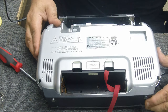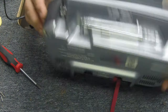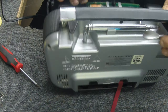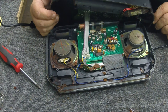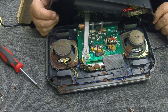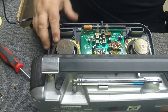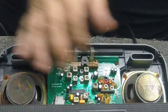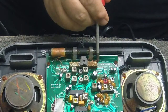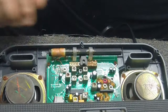Let's get her opened up and see what we got. It has six screws — one in the middle, two on each side, one in the battery compartment. It comes apart now. Oh, look at all that rust. I don't know if that's battery corrosion or rust, but wow — that's not a good sign. No wonder the side switch was giving me trouble. You can see the slide switch has got rust all over it. That explains why it wasn't working.